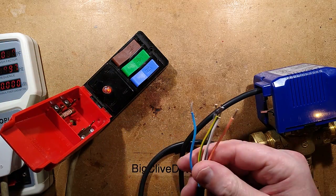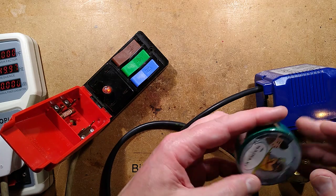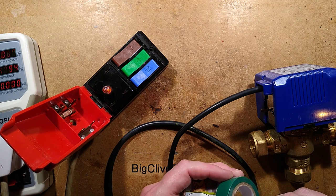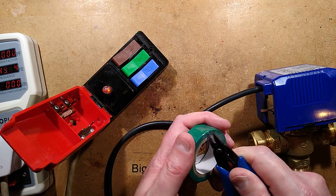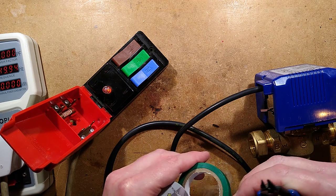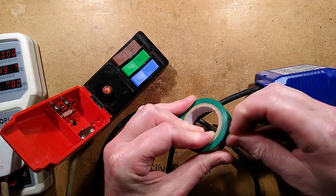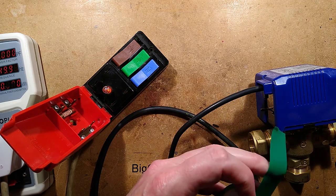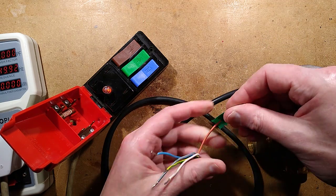I'm going to hook this up, but I'm also going to be careful — I'm going to put a bit of tape over this wire here. Let's use a bit of this JLCPCB tape, not a sponsor, just to cap that wire off because it does become live. It's not live initially, but it does become live because it's the control back to the boiler to tell it to switch on. I would guess it's normal insulation tape, made to the very finest Chinese standards. I shall cap this orange wire so I don't touch it and get a zap.